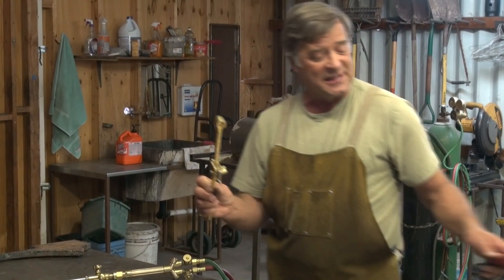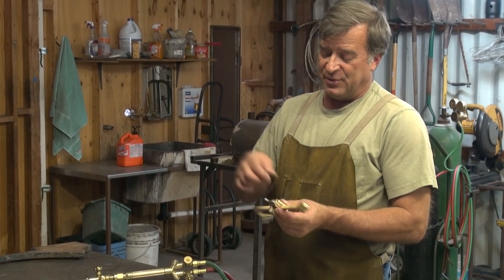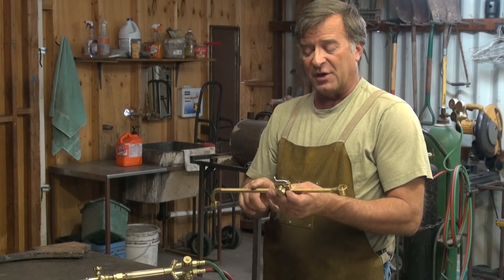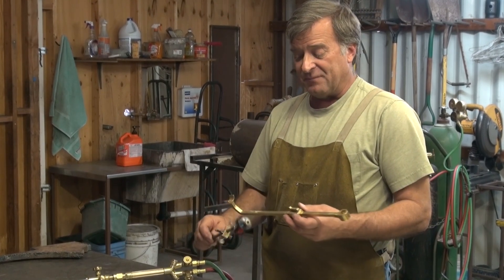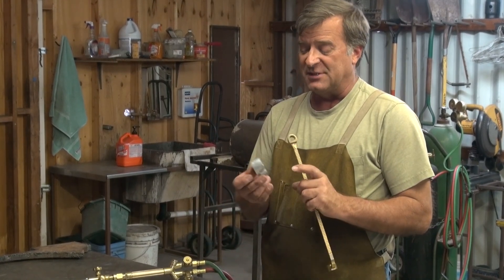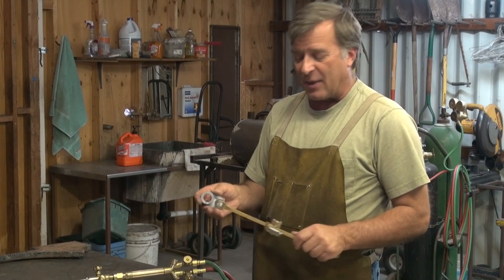I like this guy. I think this is kind of cool. It's a nice design. It's got a little set screw in here for your point so you can raise it or lower it if you want. You can also turn it 180 degrees. This rig will work from a 1-inch circle all the way up to a 26-inch circle. It's a lot more solid and you don't have quite as many parts to lose. I'll go ahead and bore this little plasma adapter out to fit my torch and play with it. Let's hook it up and burn a piece and see how it works.